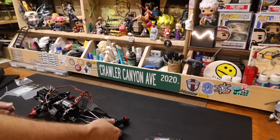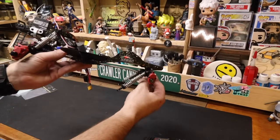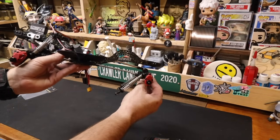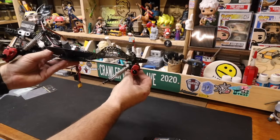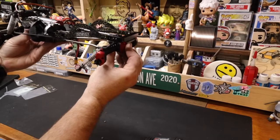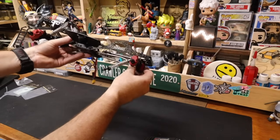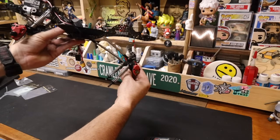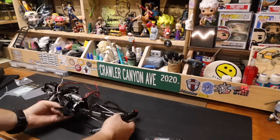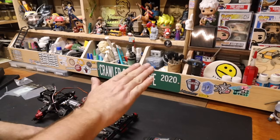So with these link length differentials, with basically 150s and 134s, you see the pinion angle is not quite, like it could be leaned back a little more. We would like a little more rear caster, but yeah, we've got room. We can lean that back more. So this pinion angle, where the angle goes like that, I don't want that. If anything, I want that pinion angle to pivot. I want it to stay aiming up.